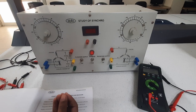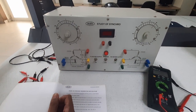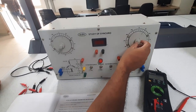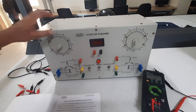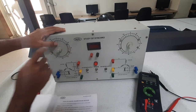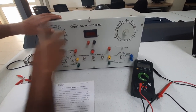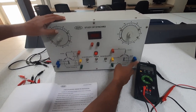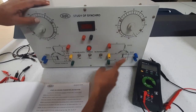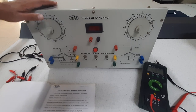The error will help us find out how much flux is getting wasted. The third experiment will be the reverse: we will apply rotor voltage on the receiver side and change the rotor position there. Obviously, the transmitter side will also change, but what we are going to do is hold the receiver's rotor with our hand and not allow it to change. When we hold it, there will be a back EMF that starts applying across that rotor. The stator EMF we are giving and the one from the rotating side will interact, and at one particular point, both EMFs will cancel each other.